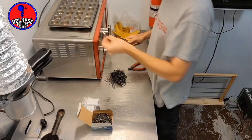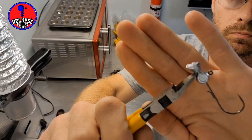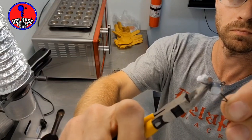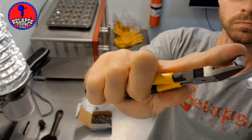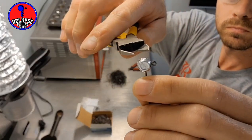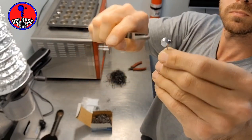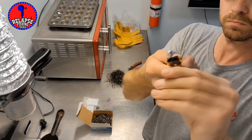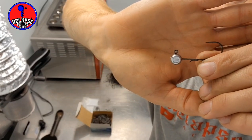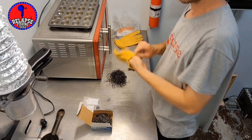Here I'll show how I clip the sprue — take small cuts, just cut a little bit and it'll kind of fold away, and there you go. I kept a round nose on it, it's not flat, and then I'm just going to clean up the edges a little bit with flush cutters to scrape it. Don't use a belt sander or anything like that — you can make a lot of lead particulates fly around and ingest them. Limit your exposure to lead. Always wear your gloves.